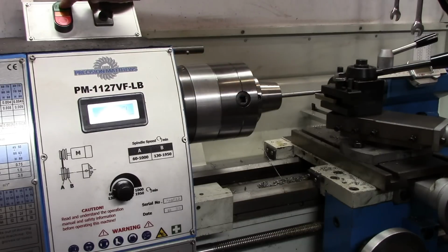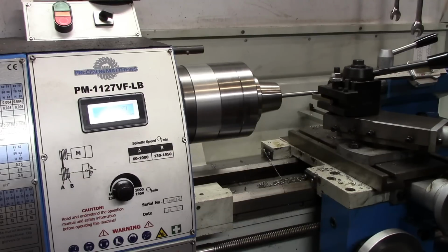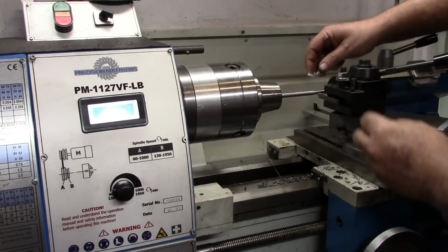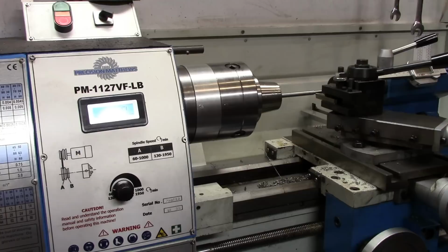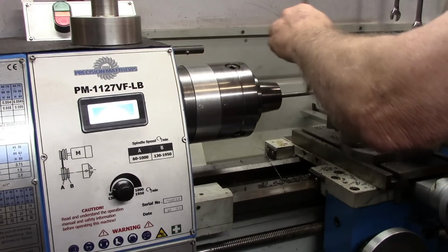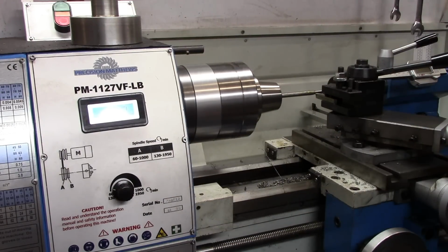I'm going to make a quick, small scratch pass and double check to be sure I got the right gears in. And that is 24 threads per inch. So we'll advance our compound at 0. As Mr. Lipton would say, a little bit of oil. Wait for the number to come around. Even number threads, I can engage on any number on the dial.